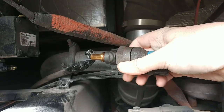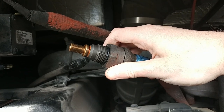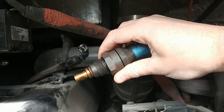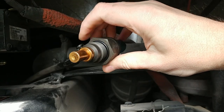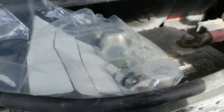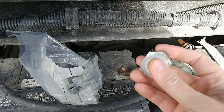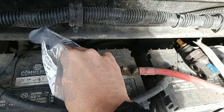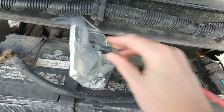One other thing — this wax valve, I bought this one on eBay. I found another place that sold the exact same thing for like $30, but I wasn't sure if that was legit. Sometimes you Google search something and it pulls up some weird obscure site and you're not sure what it is. So I just went ahead and spent the money and bought it off eBay. Now, it did not come with an O-ring. I think it's supposed to, but this one didn't. O-rings are cheap though. What I did was I bought a plug — this is a male ORB, the same size as the male ORB on the valve — and I just stole the O-ring off that and put it on there. That was actually cheaper than ordering an O-ring because they had a minimum order for O-rings. Plus, this plug will come in handy later.